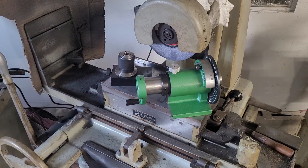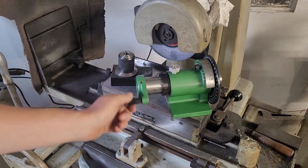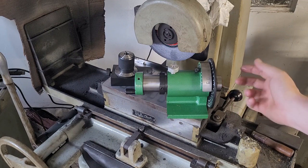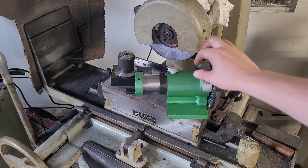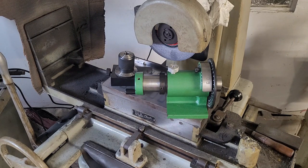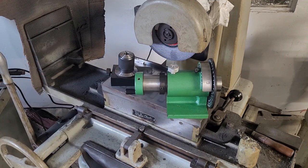These are just a couple of basic fixtures. This is a spindexer — I mostly use this to grind flats, and you can spin the part in here and grind circles. I've ground parts in it because I don't have a tool post grinder for the lathe yet. You can put stuff in a collet that sticks out at the end and grind parts very precisely, which is great especially for sliding fits. You can also modify this to sharpen the flutes on your end mill since it can slide in and out. On a lighter duty milling machine you could use this instead of a dividing head for some jobs.